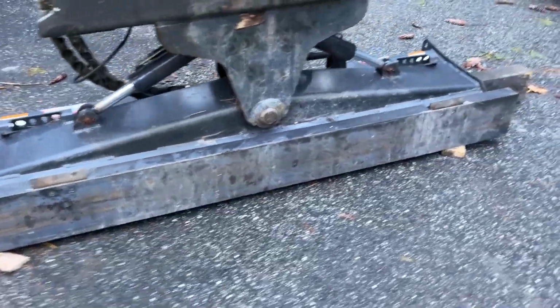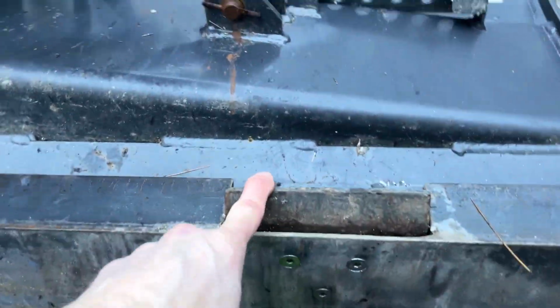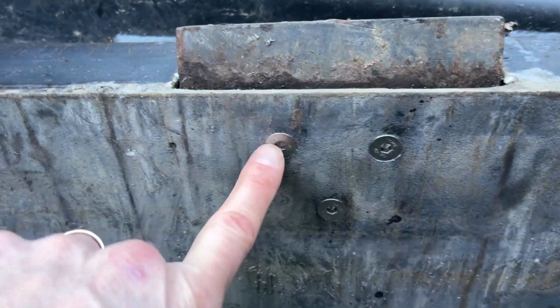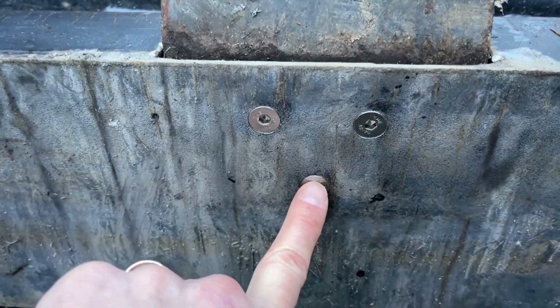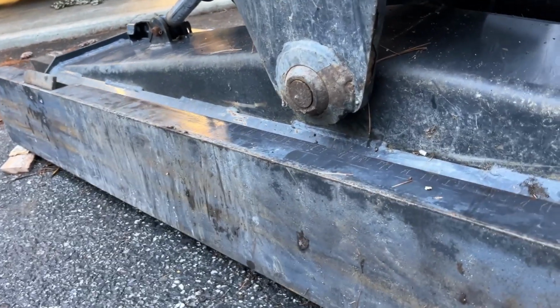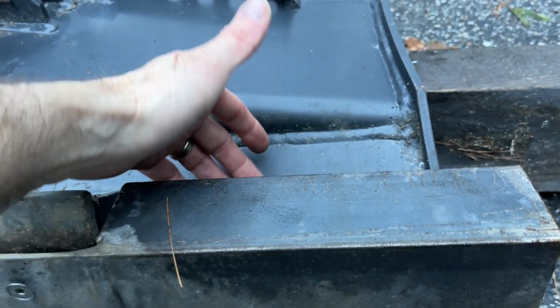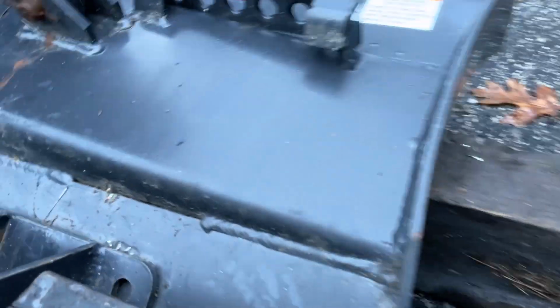So, and what I did to hold it on there is I mounted it to the existing, I don't know what they are, skid pads. And I used these, just like the other gentleman said on his channel. I'll put a link to his video in the description down below. I did that on both of them. His dozer blade had wide skid pads in this area. So he put down supports, angles, right in this area in order to prevent the steel from bending.